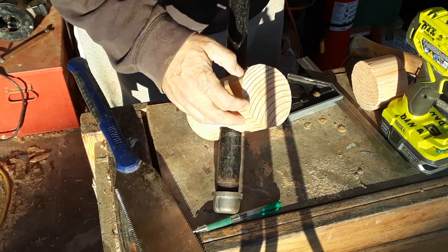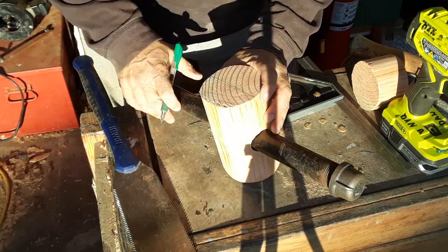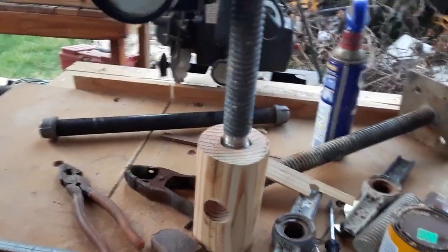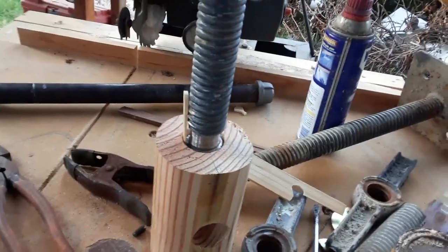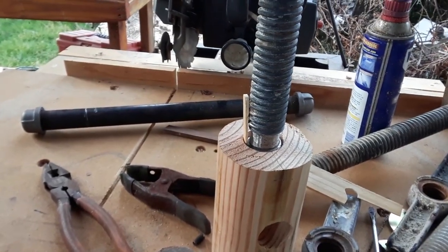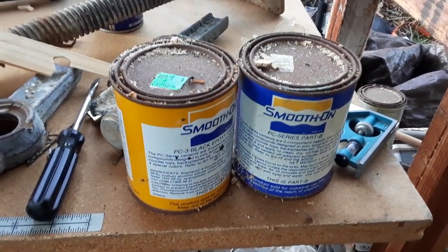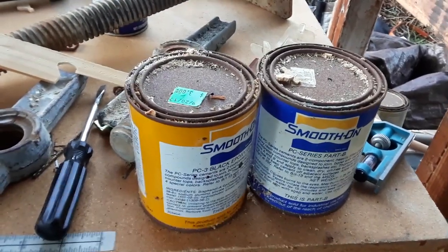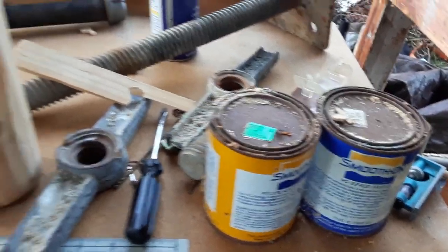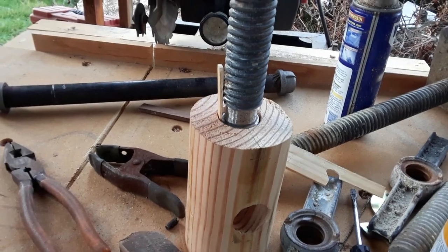And so I sighted along the handle and found this line is center. So now I do the side measurements and I will find exact center. Boring the hole was a whole bit of drama. And I've got it shimmed to straight, because the only hole size I had was the size I used for boring through, so there was a gap. And I'm going to be using this extra heavy-duty two-part epoxy. It's 50-50. It comes out black, so I'm assuming that it was used for roofs or something like that, but it works fine here. But the lower temperature rating on the cans is lower than what I would have overnight, so I'm going to wait till tomorrow to glue this on, and then final assembly begins.